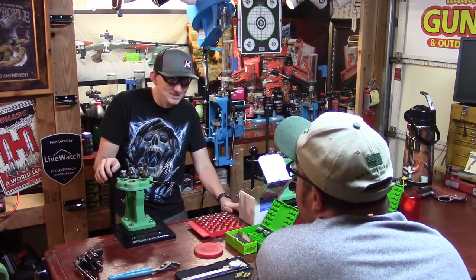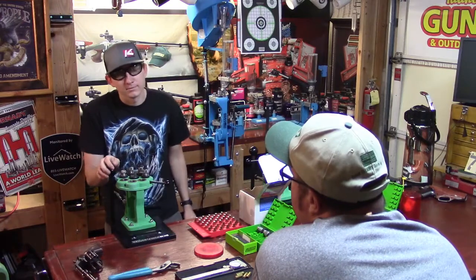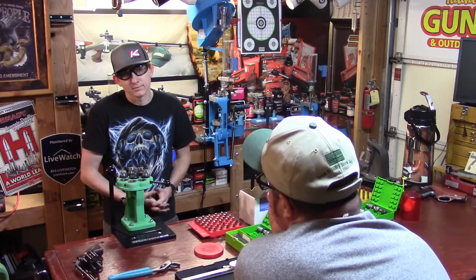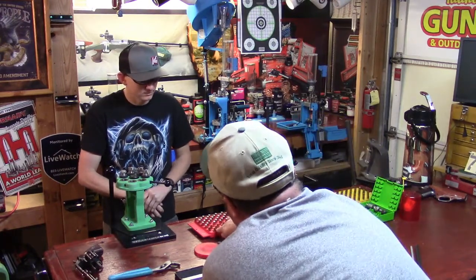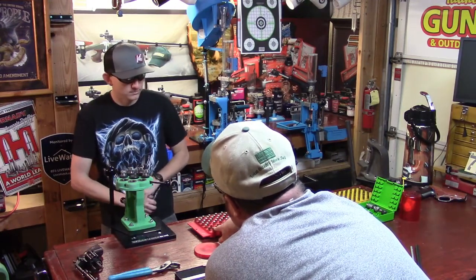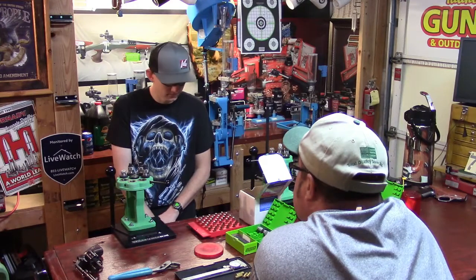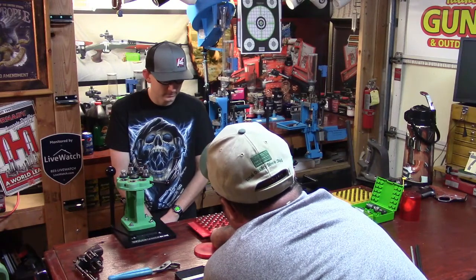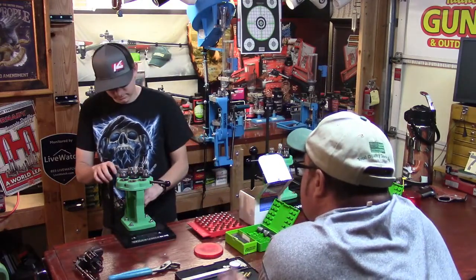I don't know. Everything in life is perspective on when you were walking in this world and where you were at. Back in the day, muzzleloader, and they're running the ball down the bore. It was a .380 diameter bore. But when they went to the metallic cartridge, it remained .380 in the chamber. That case thickness reduced that. If you didn't have the case, it was .380. Does that make sense? If you had a .380 diameter hole and you put that case into there, now that hole's even smaller for the bullet. So they reduced the bore and the bullet to match the caliber of the case. That's why.